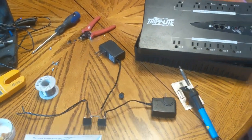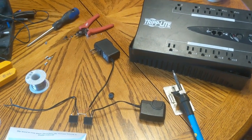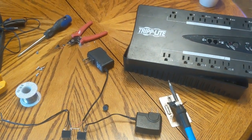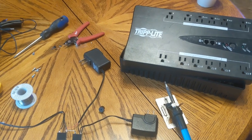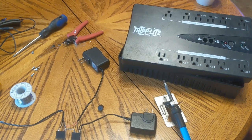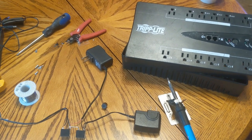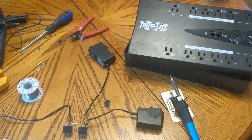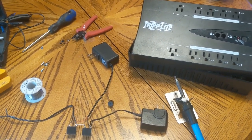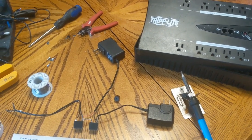We've got some Triplite battery backups — UPSs. Two of them have external batteries. I actually use deep cycle batteries, like the kind you'd put on an RV, and those will take it all the way through the night. So if we have a low-power day where we don't have enough solar and the power goes out in the evening, it'll keep our internet modem on all night long. In the morning our phones are still working, rather than being disconnected until we turn the inverters back on.